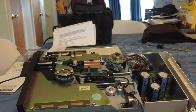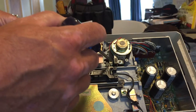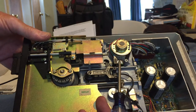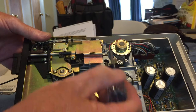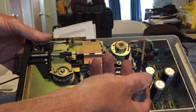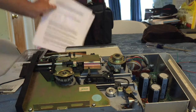The new sensor is mounted back in. I miked the distance with my micrometer and set it up for the same distance, then soldered up the wires and used heat shrink tubing, nice and good.